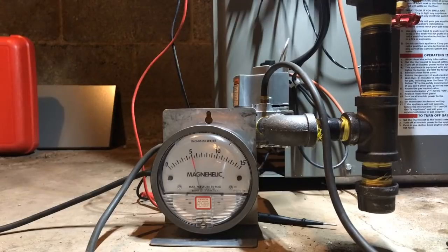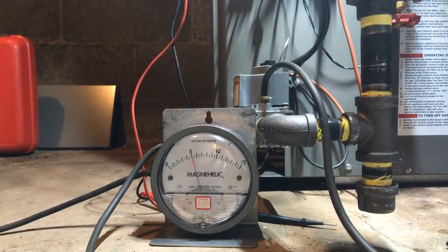Just a little over five — just a little over five. Going to fire the water heater now because I need five. I've got high pressure gas. I'm just going to dial in the regulator a little bit — I need to adjust this.